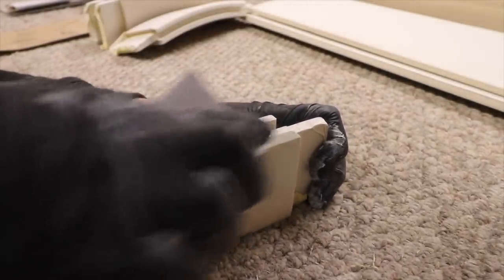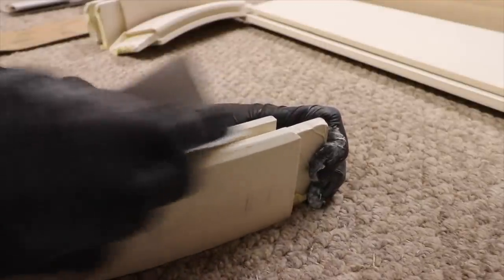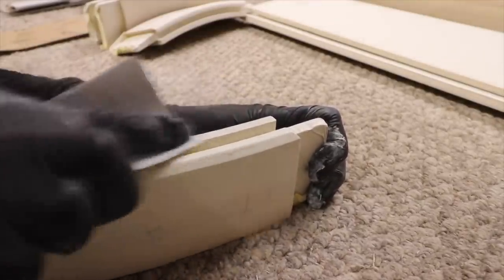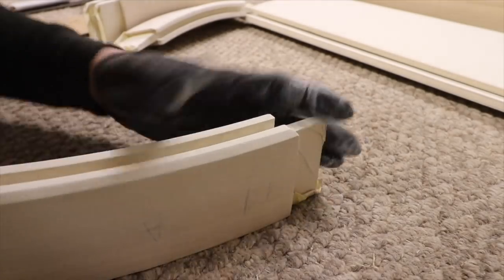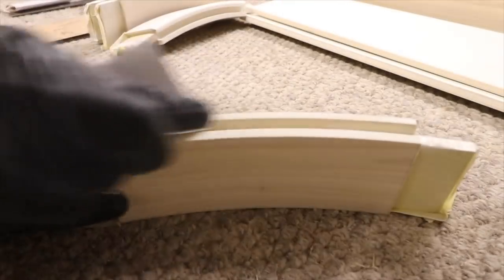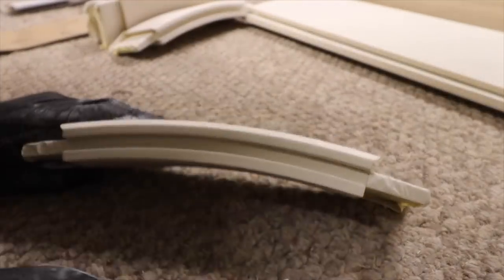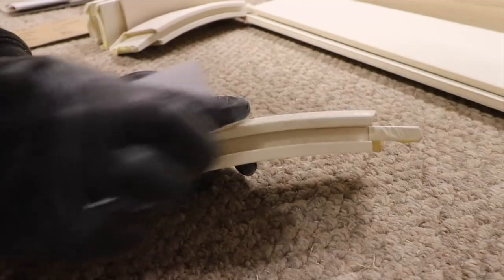So you sand in the paint until every bit of glossiness, every bit of reflection off the paint, turns to a matte colour. And you want that to happen before you break through to the unpainted wood. So what you're looking for on a perfectly primed surface is that it's fully sanded, smooth, and with no breakthrough to the layers below. So that's good enough for what I need before I glue it up, but it's going to need another coat.